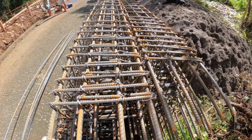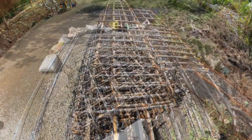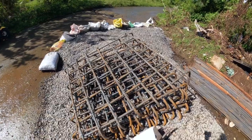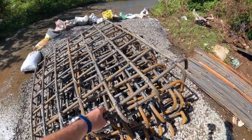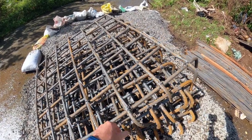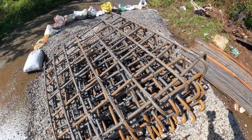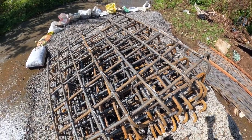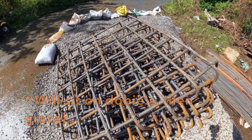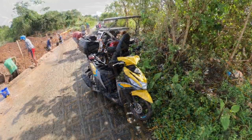Normally stirrups are more frequent at the base and gradually become more evenly spaced going to the top. So this is a beefy rebar setup for columns and I'm happy with this. What you're looking at here are the column bases — looks like they've got four. These are also 16 millimeter, and the turn-down edges will be the bottom of the footing on top of gravel. I'm happy with these as well.